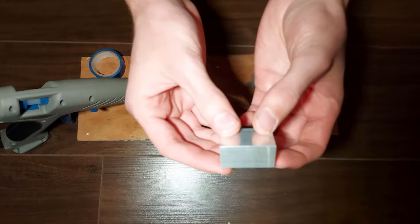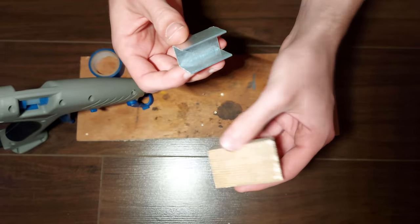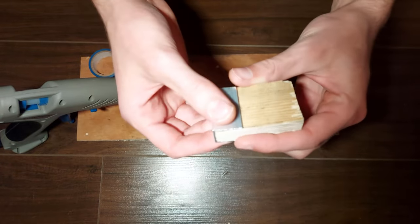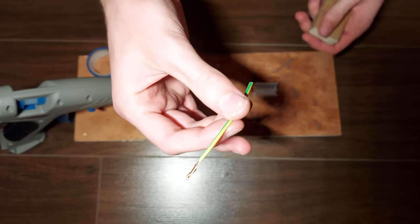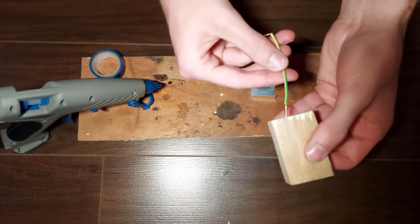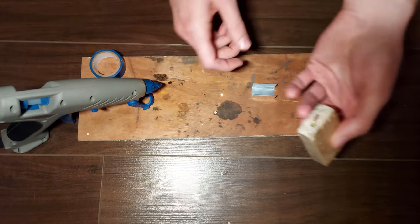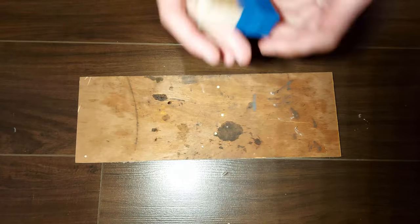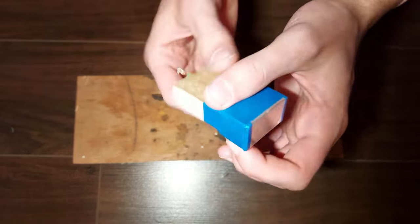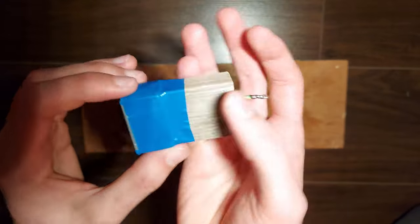For the actual etching, I quickly made a cathode. This is purely to hold the piece of cotton in place. Also during etching, the negative pole might get damaged by the process. I don't want to ruin my alligator clip, so this is basically an extension which will be damaged instead. It consists of a piece of aluminum channel, a chunk of wood, and a copper wire. I tinned the copper wire so it wouldn't fray while connecting the alligator clip to it.